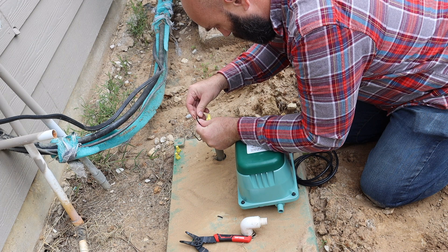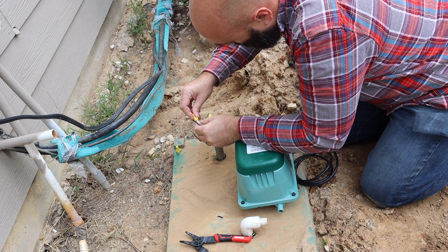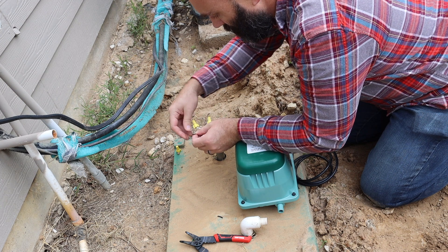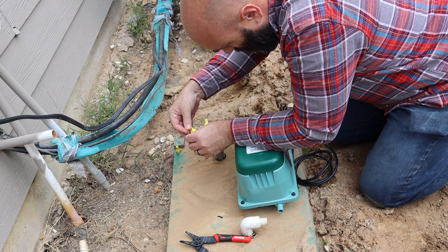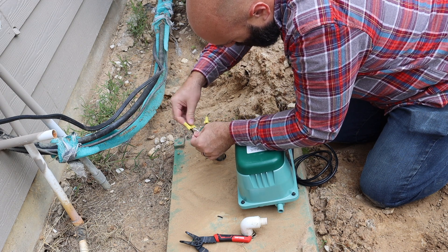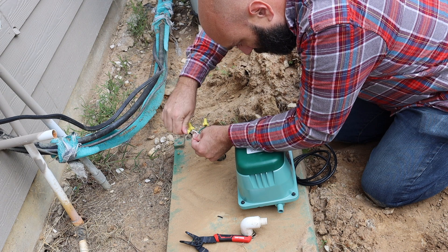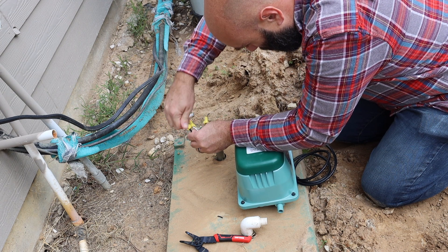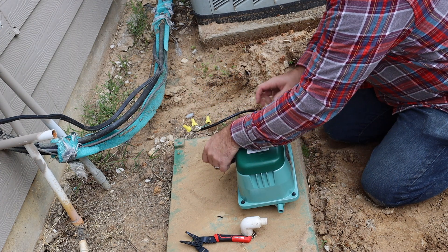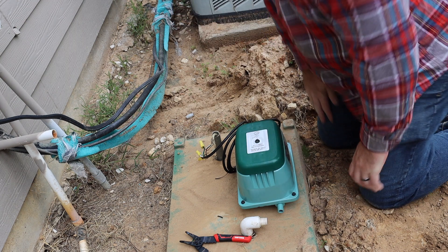Let's go to white — just wrap these around. That's nice and tight. And black. I would recommend actually cutting this outer sheath back a little bit further to make this a little bit easier, not so tightly close together. Those aren't going anywhere. I'm just going to gently bend all of that down in one big motion so that I don't pull any wires loose.